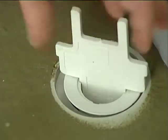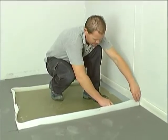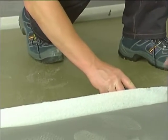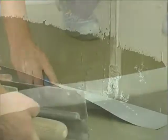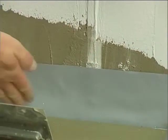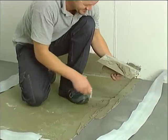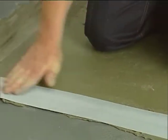The rest of the floor can now be laid to reach the height of the shower element. Cut the edging strip applied previously. Using the sealing adhesive, attach the strip that has been pre-glued to the tray to the wall. Cover the strip once more with glue. Secure the sealing tape between the shower tray and the floor and apply another layer of glue.